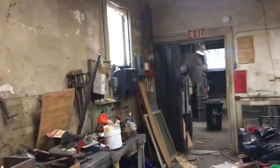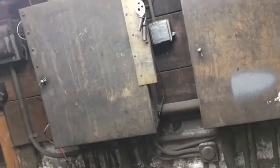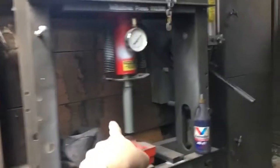The 110 panel over there is going. The electricians are coming in and we need to pull a neutral from the pole, which luckily is there. This is 240 volt at 400 amps. We only need 200 amps because I'm running everything off 40 right now anyway, so we're going to downsize from 400 amps to 200 amps. They're going to run the new 120 volt panel off of the 240, and then there will be a separate panel in the apartment.